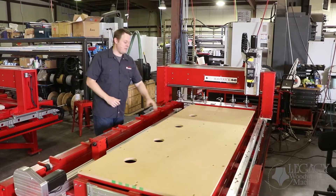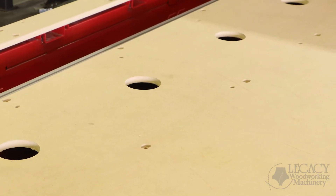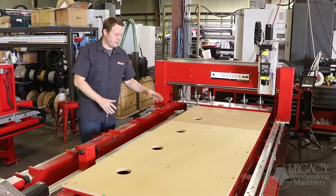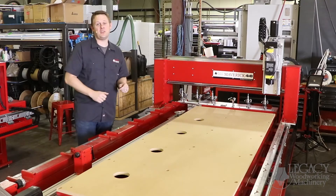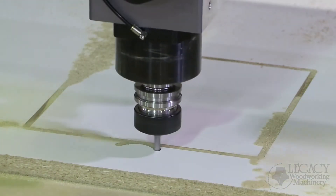Let's move on to our vacuum table that comes with this machine. The first thing you'll notice is that there's four ports for four vacuum blowers. This will pull a total of 600 CFM for your vacuum table system. There's no plumbing that you need to worry about, and you don't have to worry about a second power source to turn the vacuum system on and off. This allows you to nest more parts, because we can cut all the way to the ends or edges of our sheets without running into any risk of cutting into clamps or fixtures. Additionally, we can also cut all the way through our material without the risk of the part coming loose.